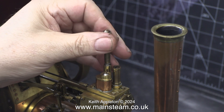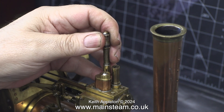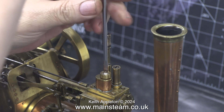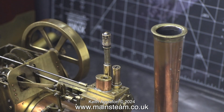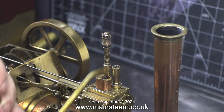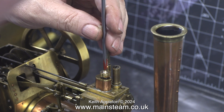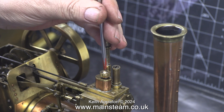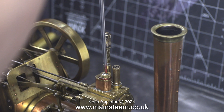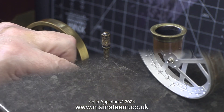This fitting on the top of the cylinder, which is soft soldered into one of the safety valves, is an airline input, and here I screwed the cap in position using a new O-ring. This is the lubricator - I modified the cap to make it very easy to remove, and here I'm removing it using a screwdriver, then I add a few drops of steam oil into the hole in the unit. I replaced the cap, and that should take care of the cylinder lubrication for quite a while. This engine runs on very low pressure and very wet steam, so the water would lubricate the cylinder anyway, but I'm taking no chances.